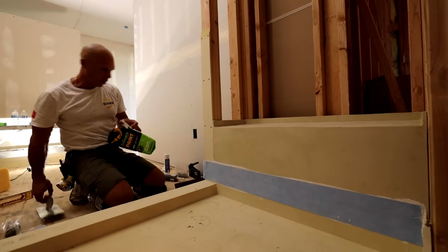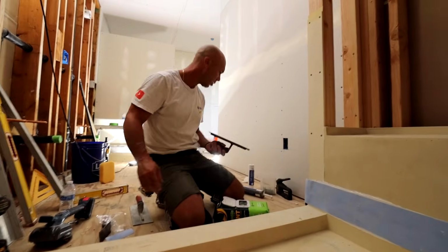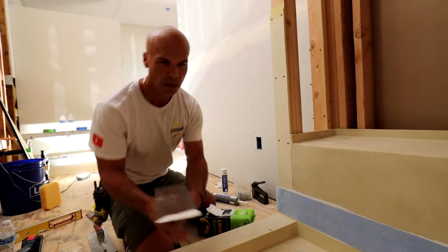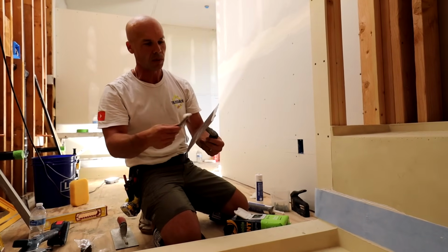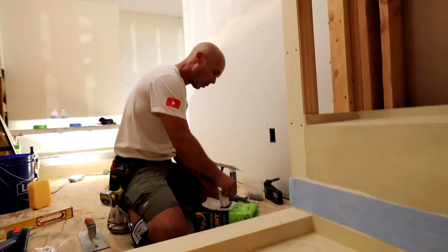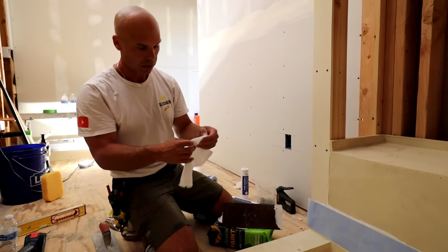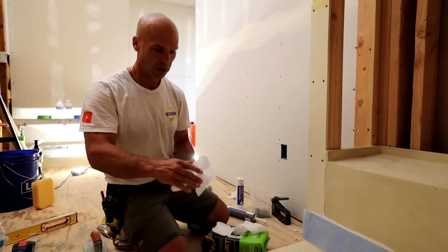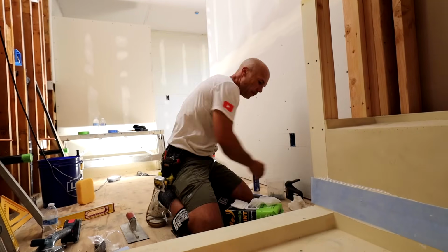If you're using tools and trowels, like, you know, I got some of this MS Polymer sealant on my trowel. You can use these crocodile wipes. Where'd you get these, Zach? Home Depot. Home Depot, yeah. Plastic putty knives are also nice to have. They're somewhat disposable. But yeah, the crocodile wipes are nice because they'll clean your tools. Water doesn't clean. Water won't take it off. So you can use mineral spirits, denatured alcohol, or acetone. But these wipes are really handy. So yeah, got that sealant off of there.